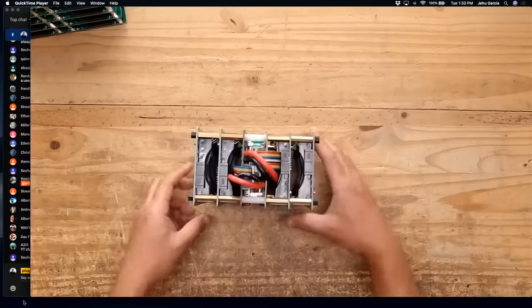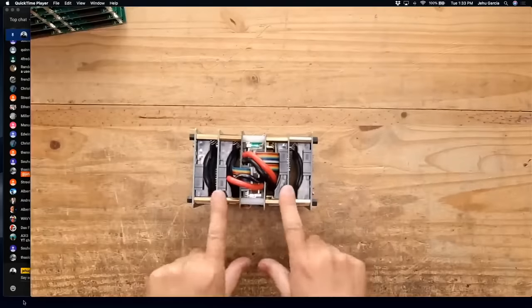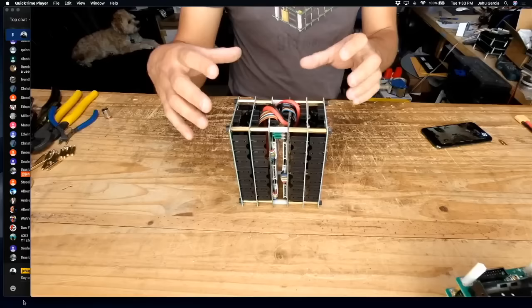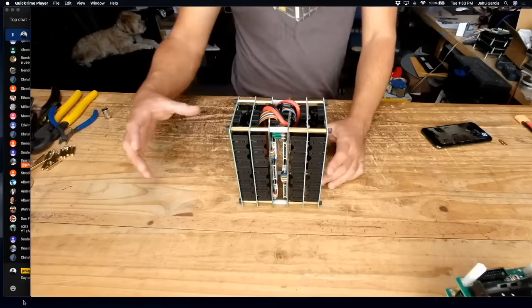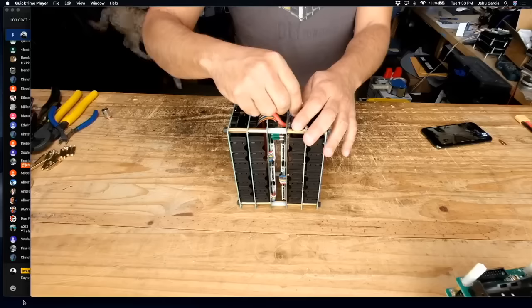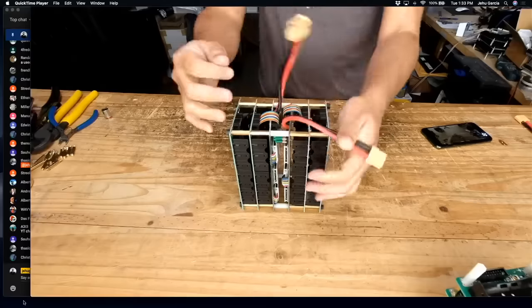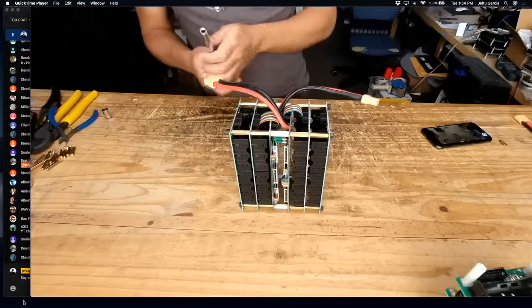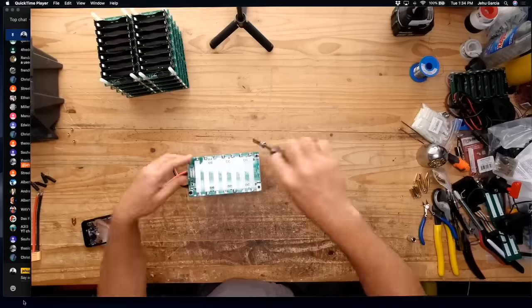And the reason you need that is because this is gonna be a 48-volt battery. These boards are 24, so you'll have to have a group of 7. So 7 boards on one side, 7 boards on the other side, and then have them connected in series so that you can make 2 of these groups that are 24 volts into 48 volts. So that's what we're gonna do here. Let's start with this because this is the one that's more technical. And so then, we'll have to adjust it a tiny bit. So there we go. Let's take this board apart.